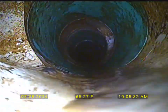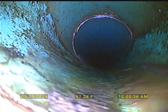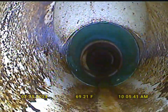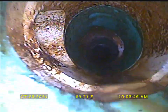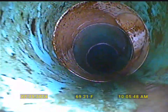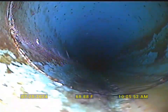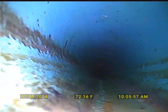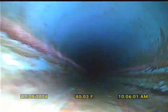This might be where the neighbor's line comes in right here — you can see some pipes. We've got a clean-out right here, and then we bump into a transition from four-inch to six-inch. So I'm guessing this part of the pipe is shared. We're still in the sewer lateral — the section that leaves the house underground — and we're going to go straight on to the road to find the connection to the municipal pipe.